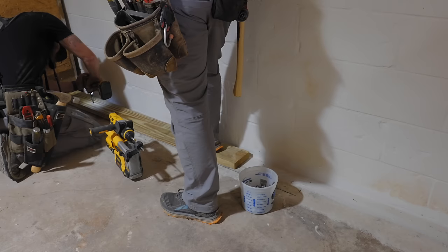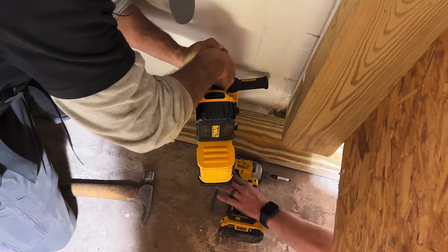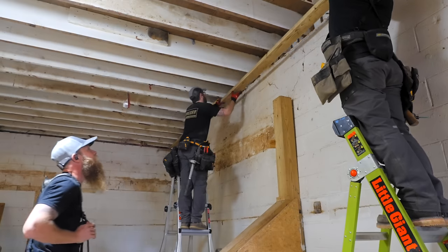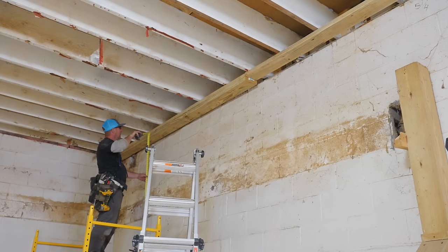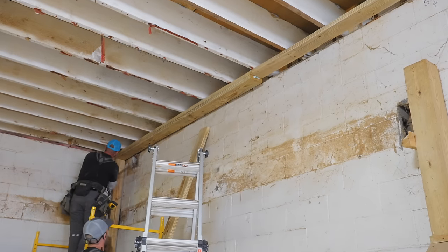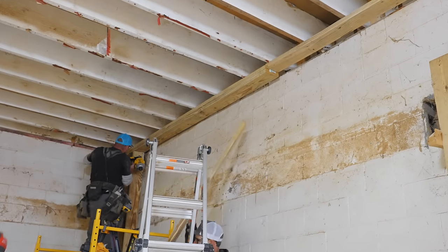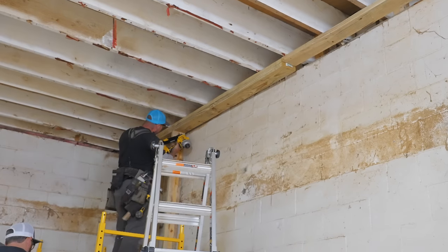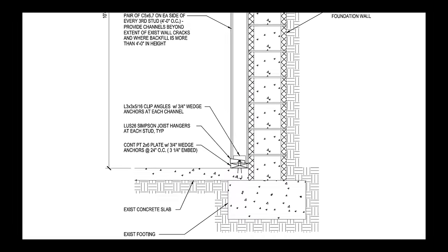We attached the bottom plate to the slab with concrete anchors just to hold it in place while we worked, as I needed to come back and connect the plates to the slab with three-quarter-inch anchor bolts as specified by the structural engineer. We got the top plate attached to the floor joists above with three-and-a-quarter-inch, 16-penny galvanized nails. Once the plates were in, we started cutting studs to fit and installing them — toenailing them to the plates. We had to frame these walls in place since they would have been impossible to stand up if built on the ground, and we could also account for the ebbing and flowing slab level this way.